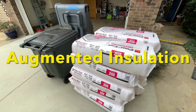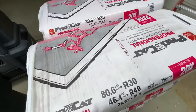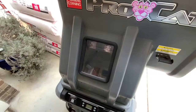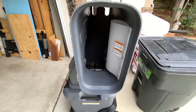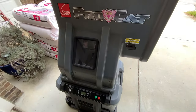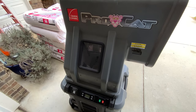The last part of this project is augmenting our insulation. This is regular fiberglass insulation, but instead of batts it's going in as loose fill. This machine blows it out through a hose and into all the nooks and crannies, creating a complete blanket between the rafters and all the spaces in the attic to improve thermal performance in both winter and summer.